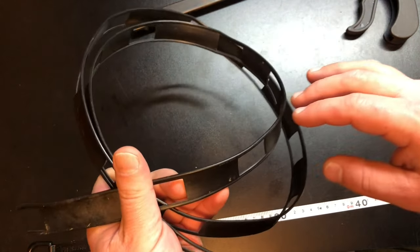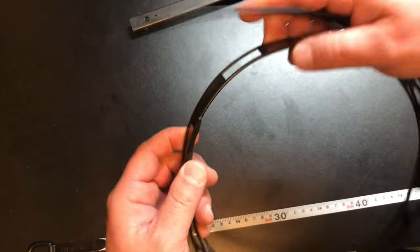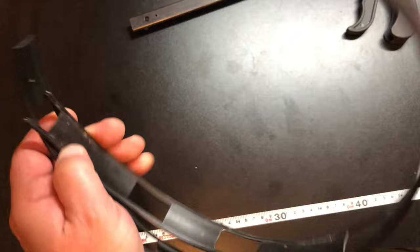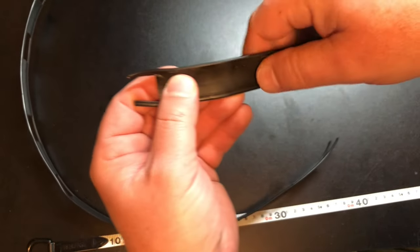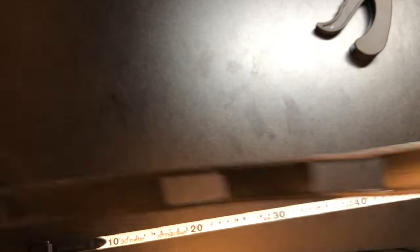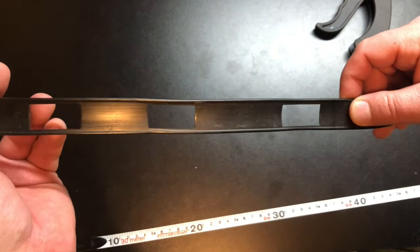The first thing we need to do is cut a length of our 450-ohm ladder line. The plans say to cut this 140.8 centimeters, so I cut it just a little bit longer than that. We're going to trim and splice both lines together on each side. This is going to be my bottom — I'm going to strip this wire here, fold them in, solder them together, and then work towards the top of the antenna. We need to make a gap in here.